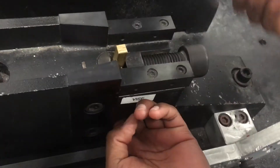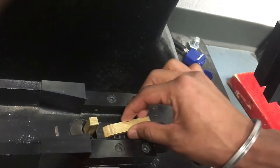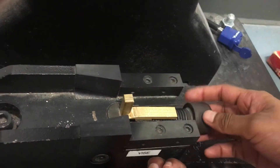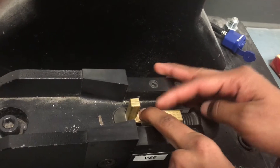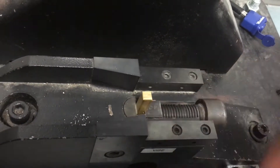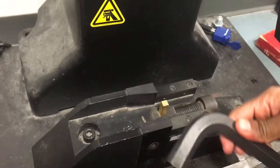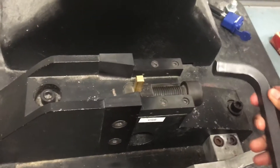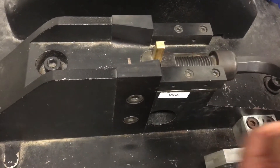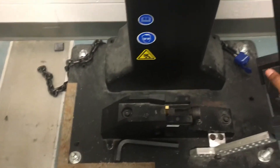We're going to give this metal support from downwards. This part keeps it in the horizontal axis with the tester. We're going to hold from this side and tie the wire. You can remove this part, and now the material is set at the zero position and ready for testing. If the vise is not properly tied, we can use this to tighten it up.